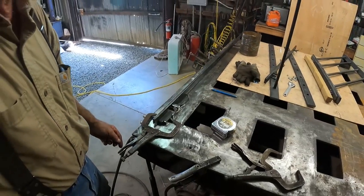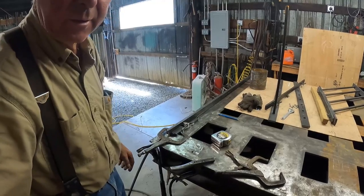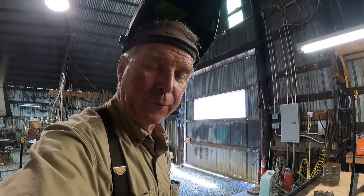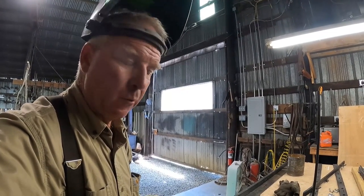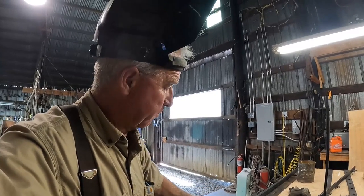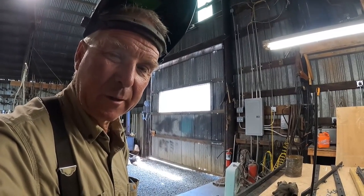So anyway, I'm gonna go ahead and assemble what I have drilled, and then we'll have to drill the top and bottom plates for the angled segments. They'll be harder, but we'll be well towards it once we get these things installed, because then it's just a matter of installing the pickets and riveting this closure plate onto the top plate. I don't know if that's what I should call them, but that's what we get.